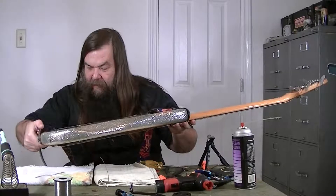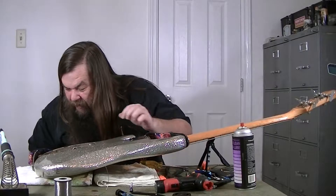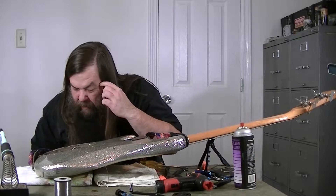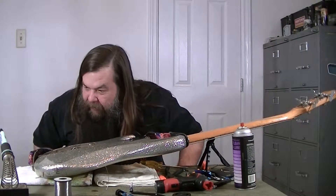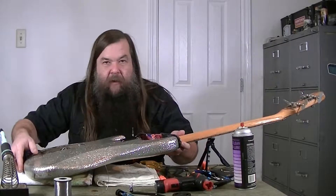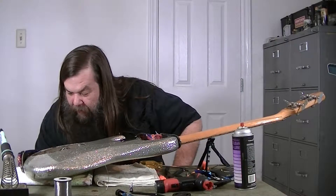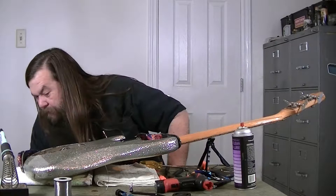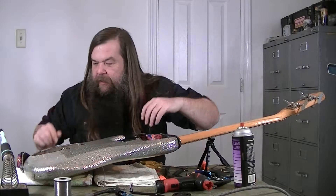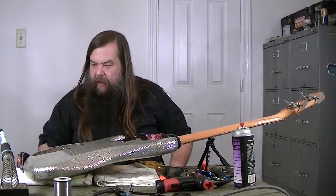He said he wasn't super concerned about getting that part right. The tone knob has actually been removed from the circuit — it could not work in these conditions with that wiring. I don't see a broken off wire, so I'm thinking I'm going to reflow a few of these solder joints. I see one here that I don't really like the look of.